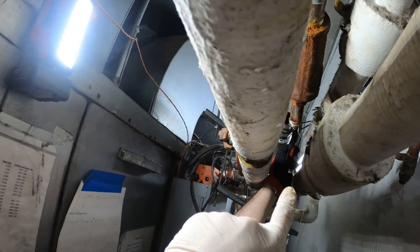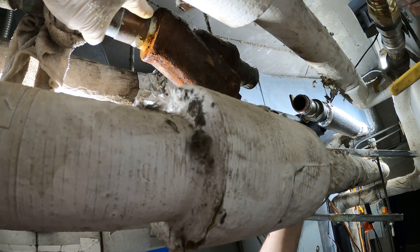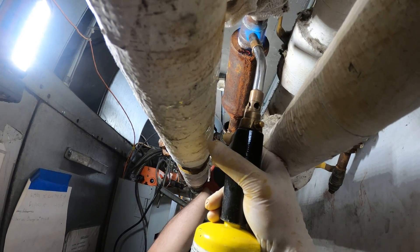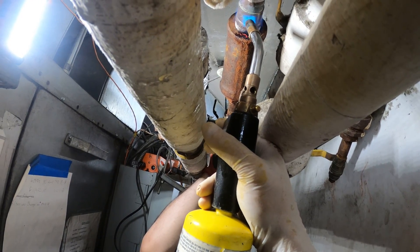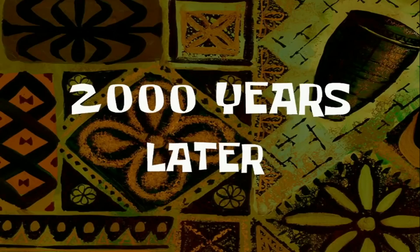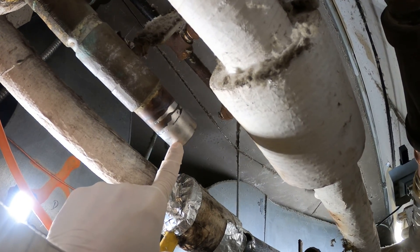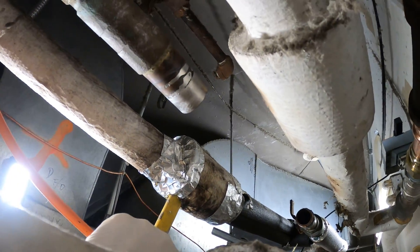So we can't spin off this strainer and we really don't have that much space, so what I want to do is unsweat this. It's ready, let's go. Got it out. Alright, so we're officially clear here but there's some solder. What I want to do is sand that off because we're going to use all press fittings from here and down. So let's rebuild this thing.